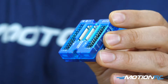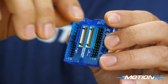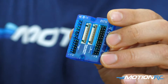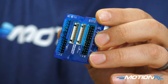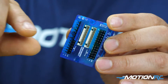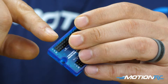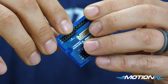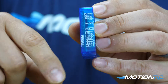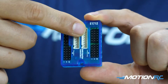Going below the light ports, you'll see the receiver section. Everything coming out of here is what's going to go into your receiver. The idea behind a multi-function control board is you can plug a lot of things in and bring it out in one shot like a Y-lead. Anything plugged in here goes to your receiver, and there's aileron, elevator, rudder, gear, flap, and aux one which could be a throttle channel - those six ports all go to your receiver.